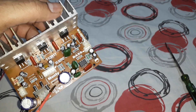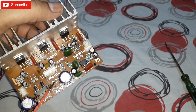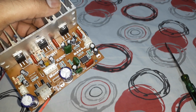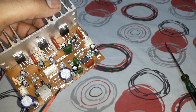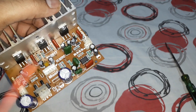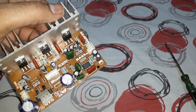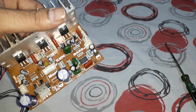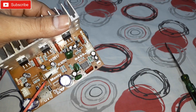There is also a place for a 5-volt power supply if you want to power a Bluetooth kit. You just mount a 7805 IC right here along with a small capacitor and a Zener diode, and it will give you a 5-volt supply from this board — no extra connections needed in your home theater or amplifier setup.